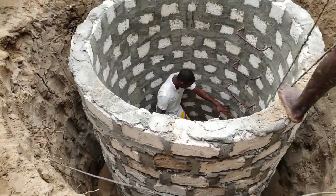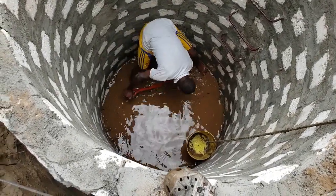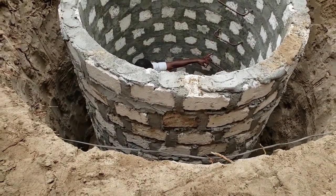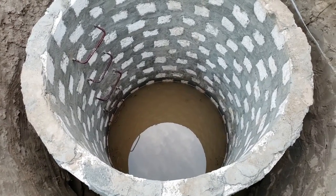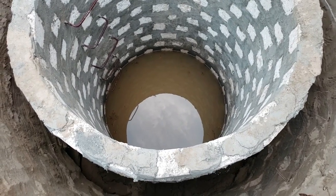The well has gone down and we are removing the sand to let the water come out. We ended up dropping the well about three rows of blocks, so we have about three feet of water there. We have dug and we have water — about two and a half feet, maybe three feet by tomorrow. The water has been rising. You can see the last chuma — the iron bar — there. The water was about three inches below it but has now risen three inches.